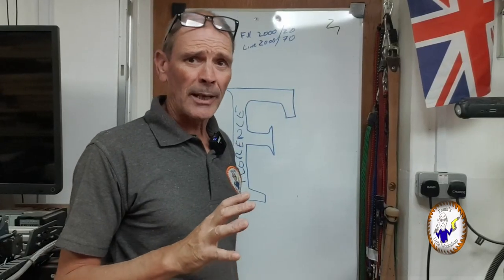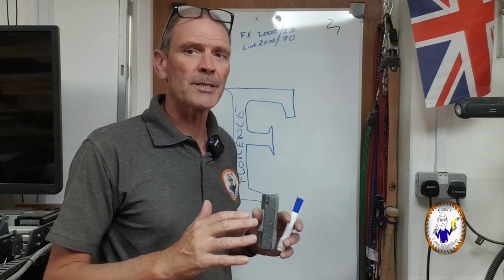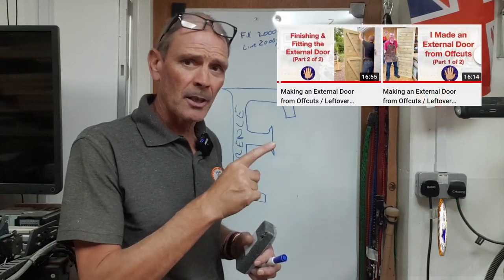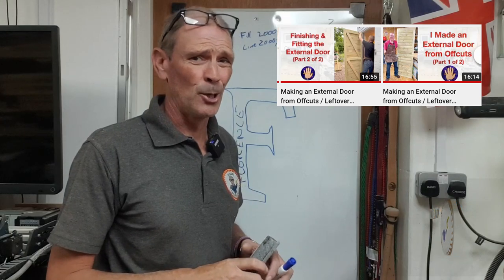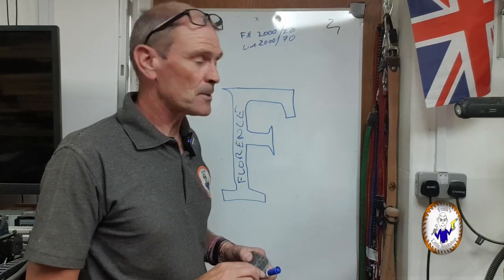Right, so what we're going to do now is quickly draw up a design for the doors. Now these doors should be quite rugged, quite chunky, but very simple to make. I'm just going to use half lap joints. Now I've copied this idea. It's a blatant copy from Leo at Handycraft. In this video, he's recently made a door for his outside loo. So I'm going to copy that. So thanks, Leo. Right, so the design is going to be this.